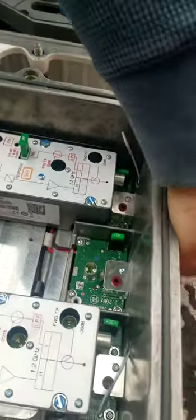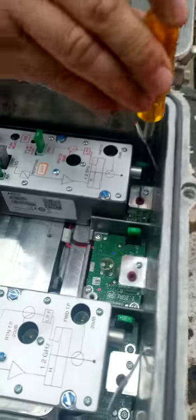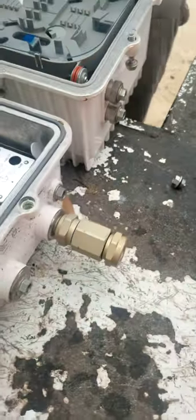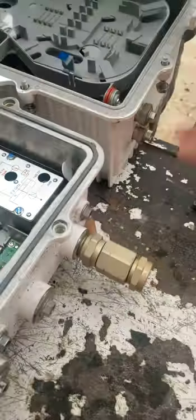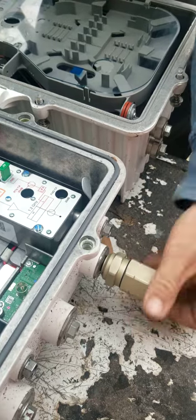So anyway, open the seizure screw, put your connector in on the cable, lock it down with a wrench, whatever. When you tighten the seizure screw, it's going to be about a half turn, maybe almost three quarter turn. You're going to feel it. Do not over torque the node. If you round these out or strip them out, it's over. You ruin the node. Now you have to get another one because we need this port, or you have to reroute the cable this way if you have an extra port. So that's how you splice the node.